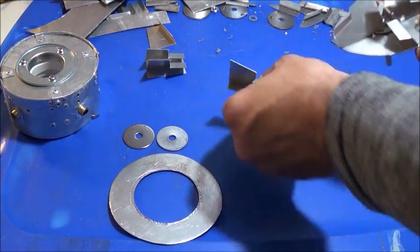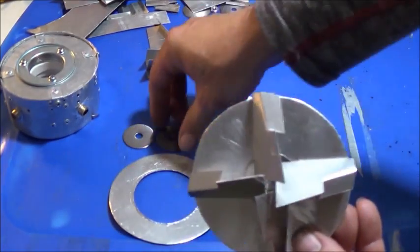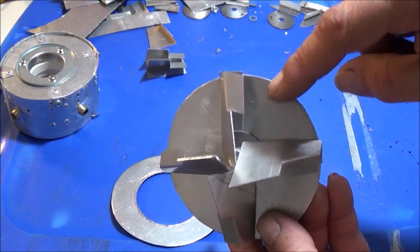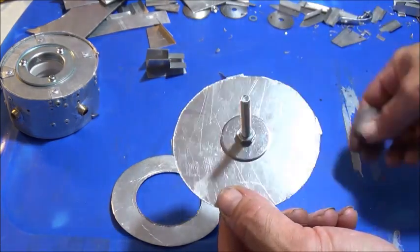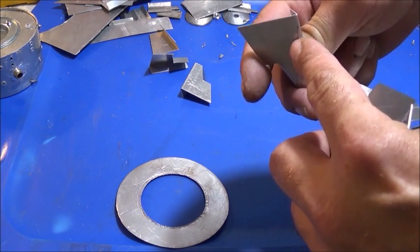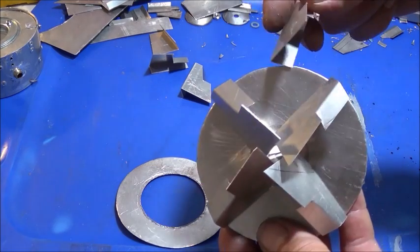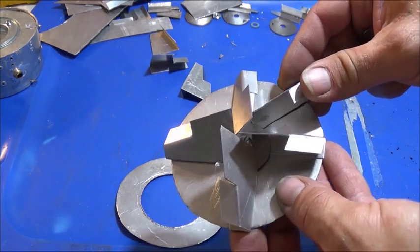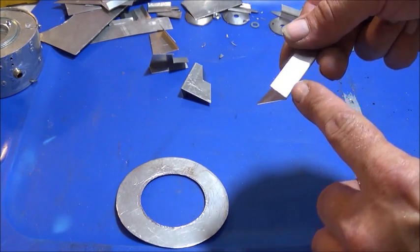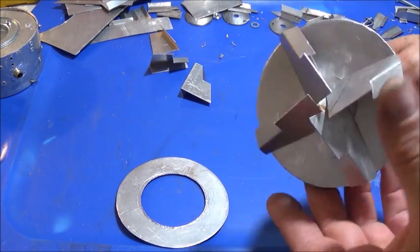Next, for each blade I take a flat plate and cut it into a disc. I use two washers — one out in front and one behind the flat plate. I cut right at the corner, back a half inch, making a slightly higher cut on the raised leaf edge so the washer edge has spacing to sit in there. I push them down between the aluminum plate and the top washer until they're sitting right next to each other. Each one gets cut a little bit into a pie shape so all eight of them will fit.